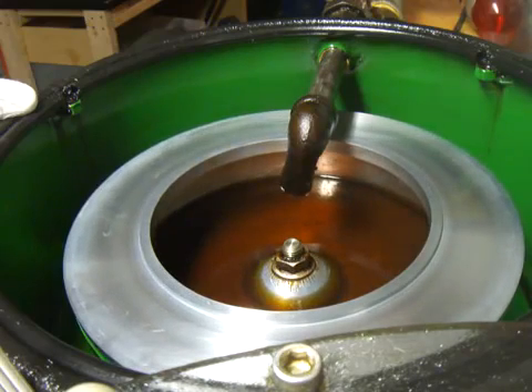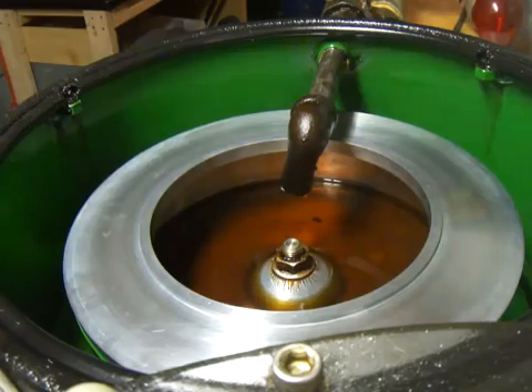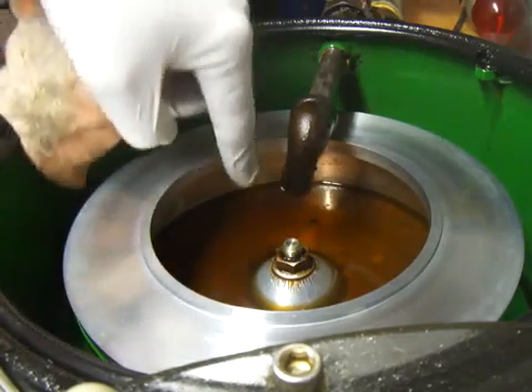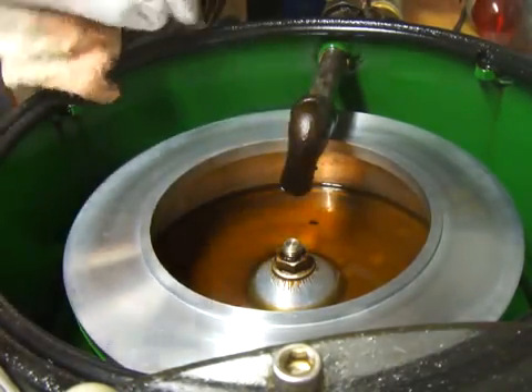So again, I'm going to plug it in and you'll be able to see it go straight back to the wall. This time I'll let it fill all the way up so the clean oil starts pouring out over the edge. You can see these chunks of particles in there — those are sticking up against the wall. Whenever it starts filling all the way up, those particles will still be back here against the back wall, but the clean oil will come over the top.